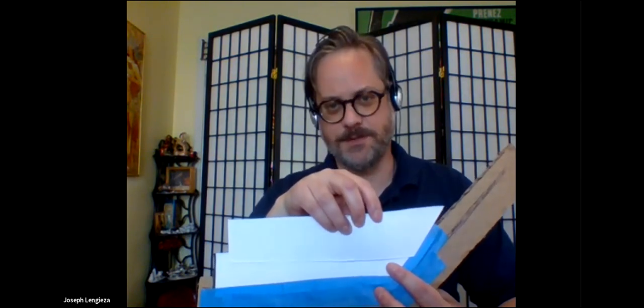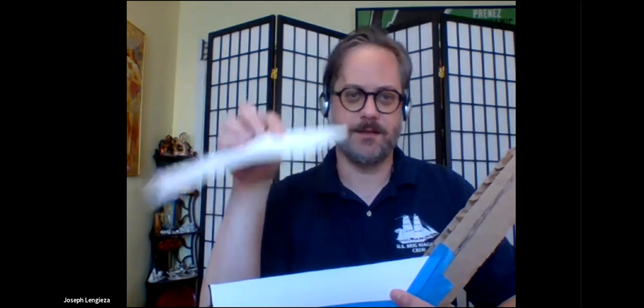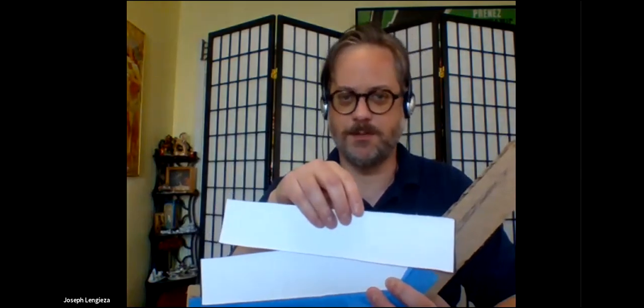And then you just start adding strakes. You know, the next one goes on there. You build in a little curve as you go. So you do better if you get a tree that's a little bent. The grain structure helps you out at the extremes of the vessel. But you're also using heat, steam, or just muscle power to bend some curve into it. And then as you go up, you just add on, you trim off what doesn't look like a boat. And on the upper strakes, you're more likely to have more than one plank going across the length of the boat.